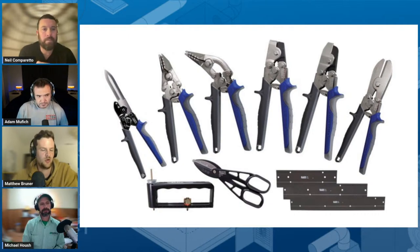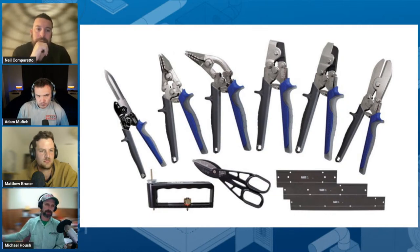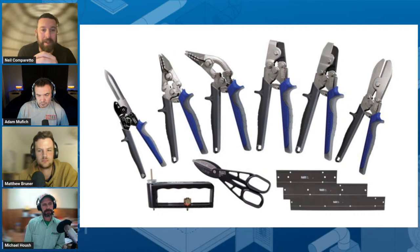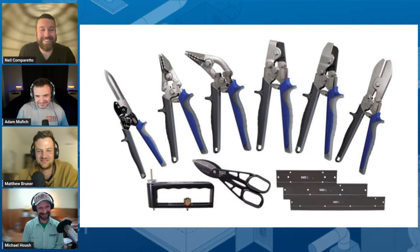All of that has to be planned in advance — you've got to carry a certain amount of metal to these jobs. We get five-foot by ten-foot sheets of metal from our supply house and that lasts a while. We also bring S-slip — some people call it slides or S-cleats or S-locks — which helps you interlock pieces together.